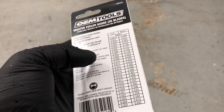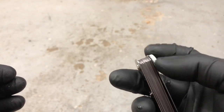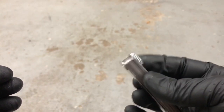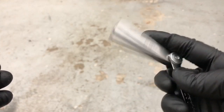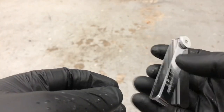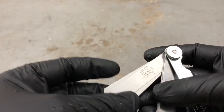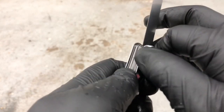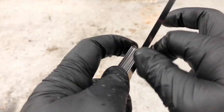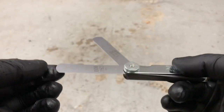And for metric it goes from 0.038 all the way up to 0.635. Let me get this thing opened up and show you what it looks like. It's got a set screw right here which you tighten down — what that does is it tightens the whole thing. Everything's really loose right now and just falls out, so you pick your gauge size — this is 0.08 — and turn it all the way down. That tightens it up so these don't fall out anymore; it keeps it at whatever size you need.